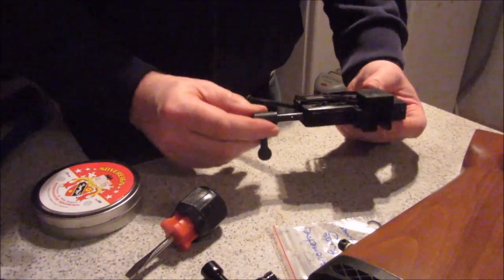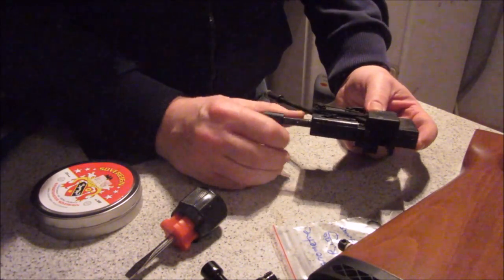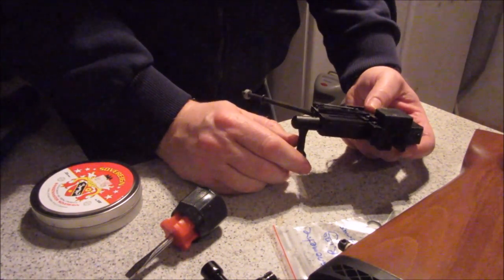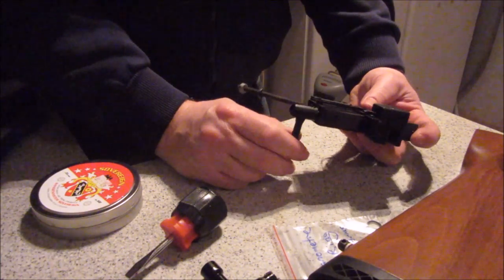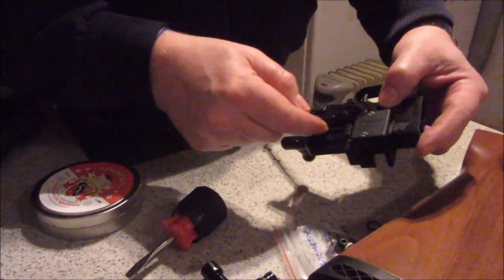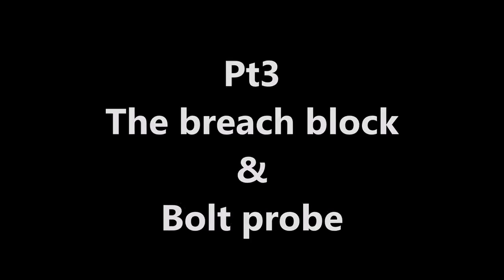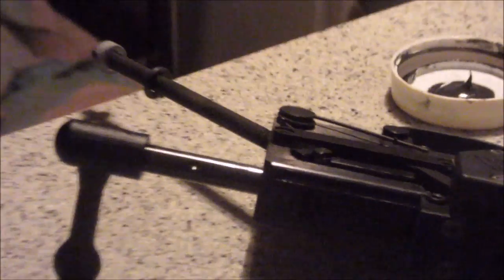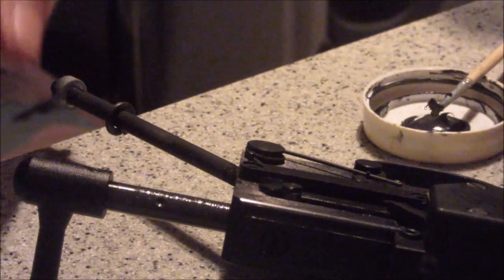Save your fortune there. Right, what happened on the firing mechanism? As you can see, there's a bolt. This nut here, it's sheared off, probably for the first time in 20 years or whenever the rifle was built. So I couldn't get the nut out, so I had to replace this. It cost about £30 for the whole thing from John Nibbs. So what I'll do now, I'll just grease it up down there so it makes the cocking better. That's better, it's better already.